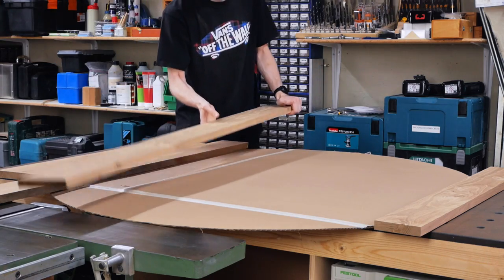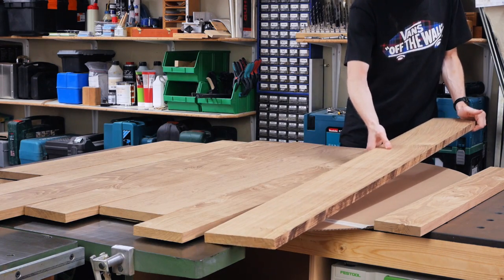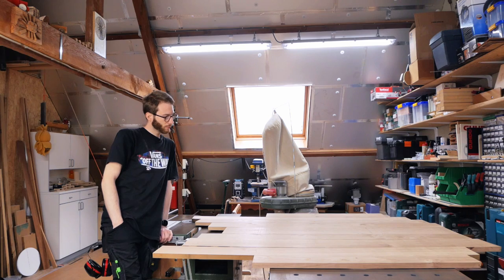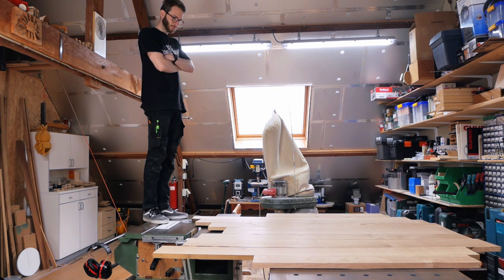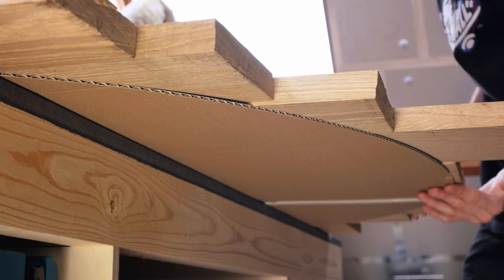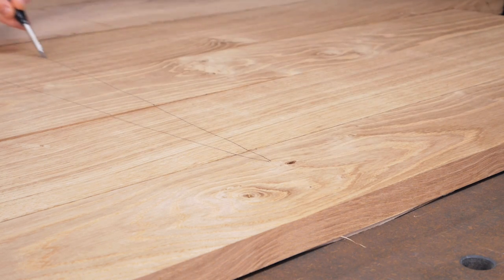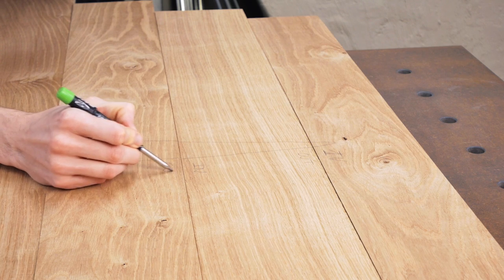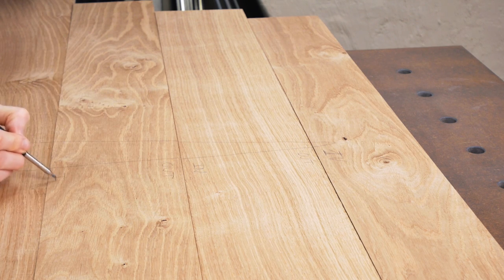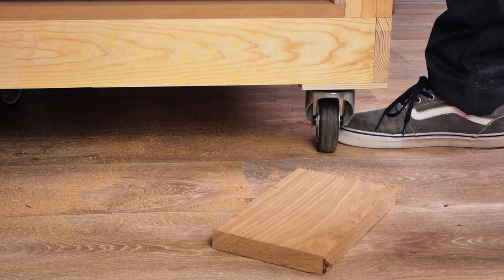I try to make a nice mix between rift sawn and plain sawn boards and lay them in the right direction for stability. When I get to a combination I like, I look at it from many different angles to make sure the grain is looking good from every possible angle. I make sure the boards cover the cardboard circle and mark them to lock their position. Next I'm making the edges square using the in-out method, which I've learned from Chris at 4eyes. He's got some great tips and tricks videos explaining this method, and I'll put a link in the description below.